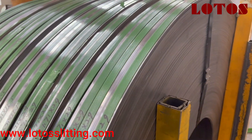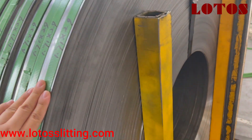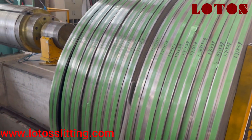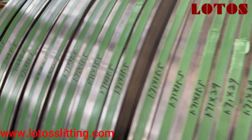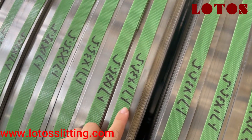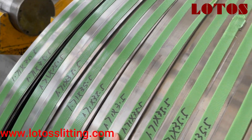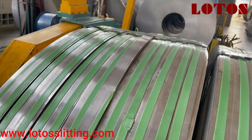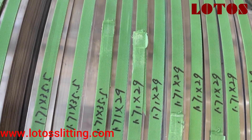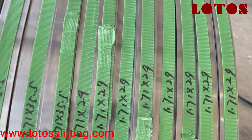In this scene we check the recoil quality. You can see different weights but the same thickness — 1.71mm. This part, the weight is 35.5. They make one batch, one slot, one lot. The specification is 1.7mm thickness plus 29mm width.